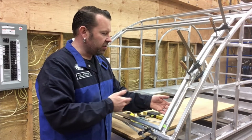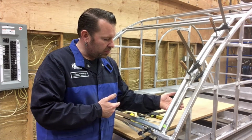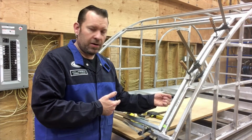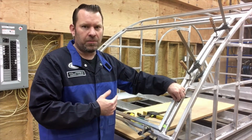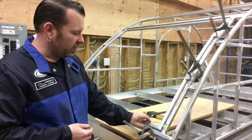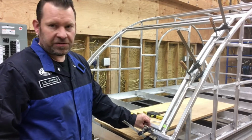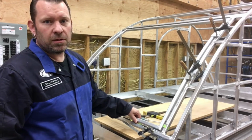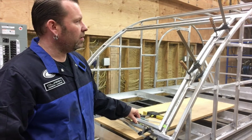And then once this is all done, I'll get to the gutter part, and where there's a 1/4 inch raise, there'll be a plate that comes out with a return on it, and there'll be a seal there. So there'll be a double seal. If I really wanted to, I could put a corner seal in, but I think that's probably overkill. And then it'll have a drain system at the bottom. So this is a little bit different down here. So I'm allowing for that extra thickness of material here. But this is basically what I'm up to. I'll show you the other side, how I built it, and we'll go from there.